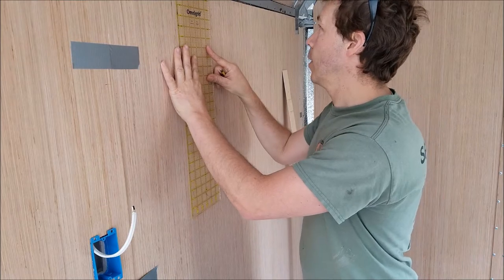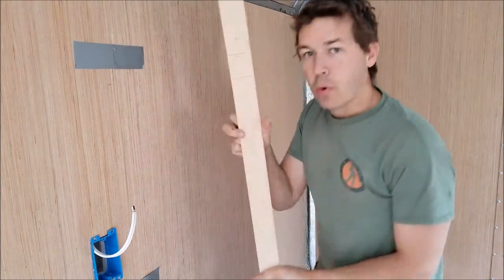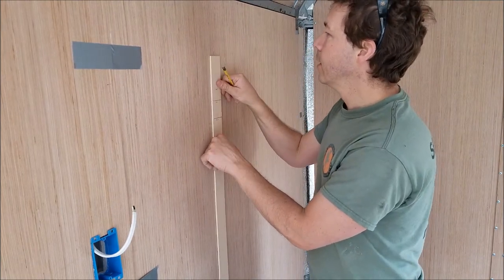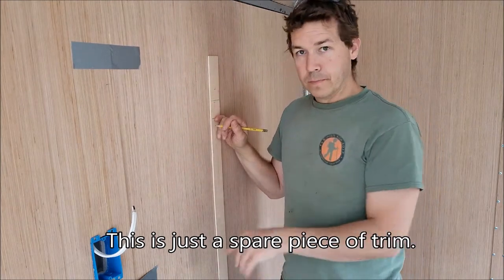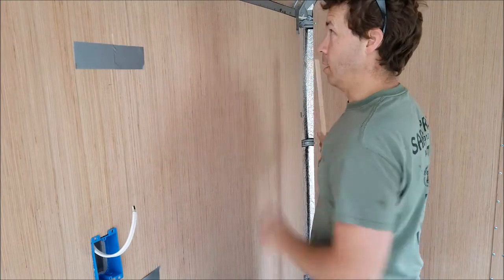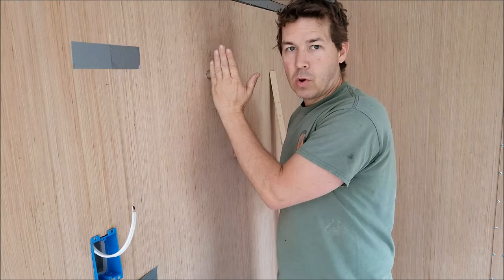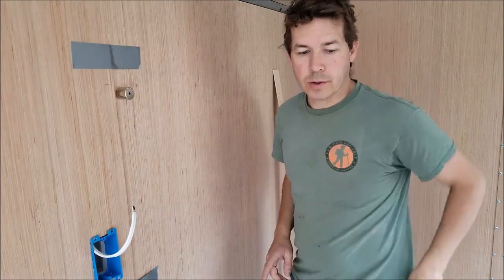I'm marking the center point down here at 17 inches, using a measuring board I made that has markings on it — one for when I have trim on the bottom and one for when I have no trim. I line it up to the center line and mark right where the holes are. The spacing is basically right and they'll line up on the beam on the middle rail. Then I use a big magnet to check that I'm fairly close. If it seems offset a little bit, I'll offset my drill hole slightly to make sure I'm hitting a good piece of that metal underneath. Make tools that increase your speed and productivity.